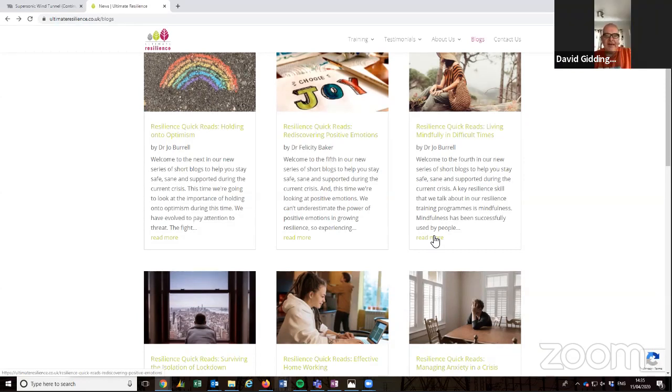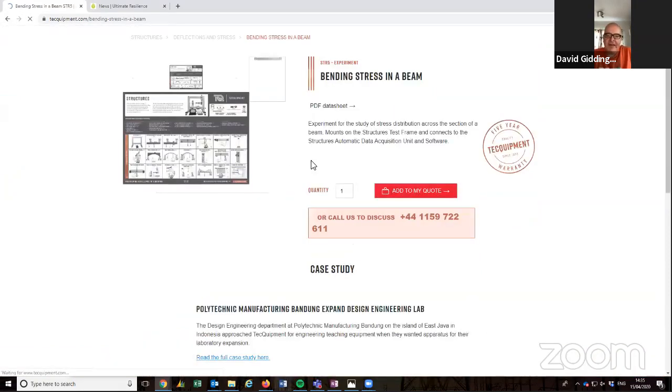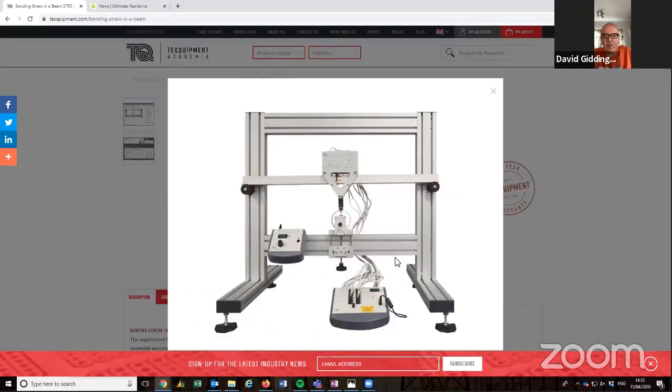Yeah, so this applies to the STR5, STR8, STR17. Wherever we have strain gauges, we need to measure the strain using a strain meter. The important thing on all these experiments is that we need to take out any friction and any sticking in the experiment, and we do that by applying the preload. So with the load cell, the STR8A, we wind that up to 100 newtons, and then we zero everything, leaving that 100 newtons applied. So we take the force meter back to 0, and then we individually zero or tare the individual strain readings on the strain meter. With a small trimming tool or a small screwdriver, we just move around all of the channels. It might be 17 channels, might be 13 channels. We zero the channel numbers individually, and then you're good to go.